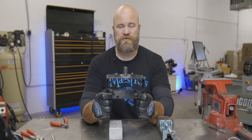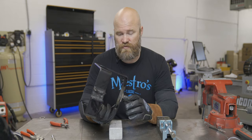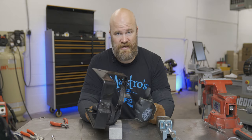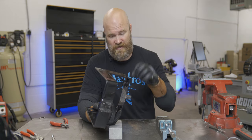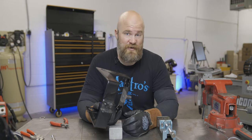Simple little repair. I know this was a quick video, but hopefully if you've never done some kind of weld repair, you picked up a few tips. Mainly: make sure you've got everything clean, get any kind of crack cleaned out, get the old weld cleaned out, and get a good chamfer so your new weld can get laid in there and it doesn't re-break. And that's pretty much the basics.